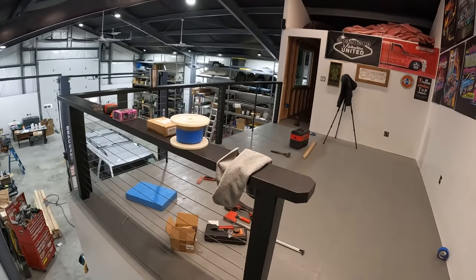Everything else seems good. Everything's nice and tight, so nothing should go anywhere. But I was going to repaint the top, these rails and stuff again anyway, and I scratched them up in some spots tightening these turnbuckles up. So I'll let it sit for a little while, and then eventually I'll repaint, because I actually used latex paint on these rails, and I got some black oil based paint I think I'm going to use, just to give it a little bit harder finish, so a little more durable. But that's it. So y'all can see.